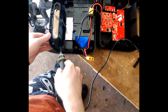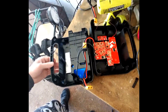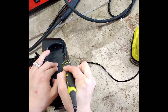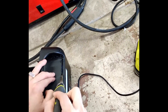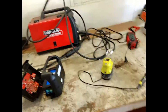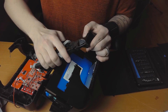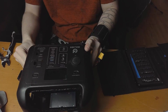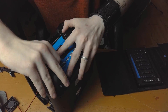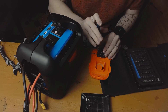Speaking of awful, I have to wear a mask while I do this — this is a stupid idea, never copy this. Instead of buying a Dremel, I just have a dedicated soldering iron for melting plastics. It looks awful and it is also awful for you — do not do this — but it does work, and allowed me to carve out a space to put this inverter into the power bank. I'm carving through all of this stuff trying to make room, and it works out for the most part, though it probably took several years off my life. Now I'm reassembling this thing using the pre-existing screw mount so that it holds itself together solidly. This inverter is going to plug in where the previous one did, and this time it's almost certainly not going to destroy itself as quickly.